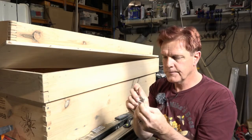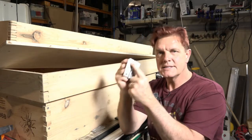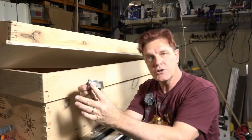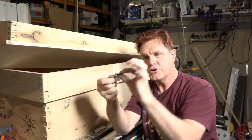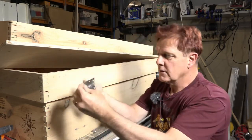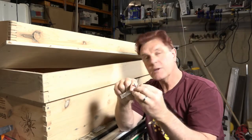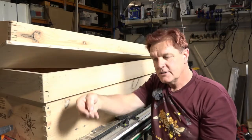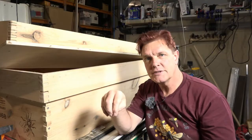Like so. Now it doesn't matter that I've got the nut sitting proud like that because it's not going to be closing over like a normal house door. It's just going to go to 90 degrees and that's fine. All I've got to do is drill those in. These are 25mm, which is an inch, and that'll be just enough to get to the other side to lock the nut on, and then 3 per, and we're rock solid then.